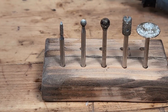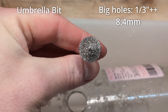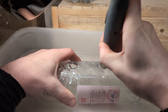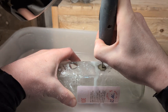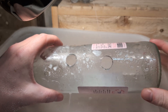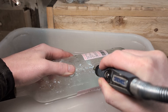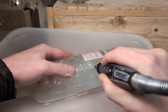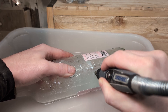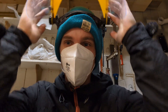Here are some of the bits I prefer when drilling different sizes of holes in glass. For bigger holes, these umbrella diamond bits work really well. They do not produce the cleanest holes, but we can clean the holes with a finer diamond bit like the Dremel 663 glass drill if needed. When using coarse grit and drilling glass in general, there is always a chance of flying glass at fast speeds, so I always protect my eyes with a face shield and also use a dust mask.